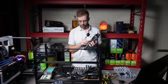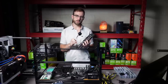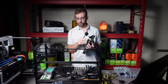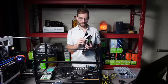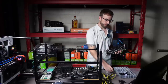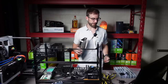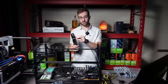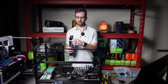Back to power. The 80% rule — you run any electrical current on a circuit, whether it's a circuit in your house wall or a circuit in your mining rig, you want to make sure you're only running it at a max continuous load of 80% of what it's rated for. The reason you do that is to take into account any spikes that may happen in the electrical current. And if you do that, you're going to be really safe.